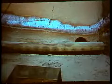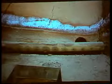Most ash hoppers use pressurized water to stir up the bottom ash being removed from the boiler. This helps get all of the ash out of the boiler. Pipes and nozzles are used to direct the water spray. You must inspect these pipes and spray nozzles for ash blockage and misalignment caused by clinkers falling on them.